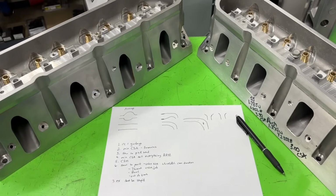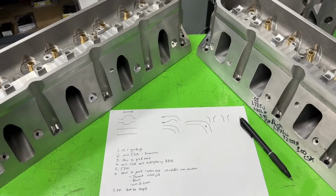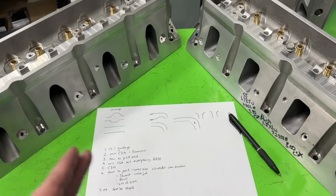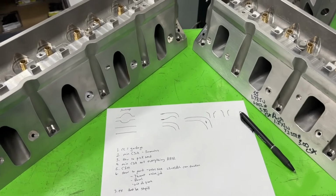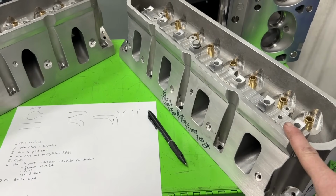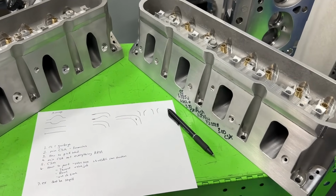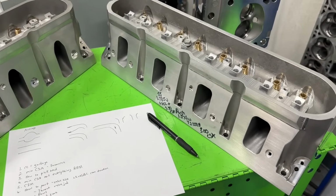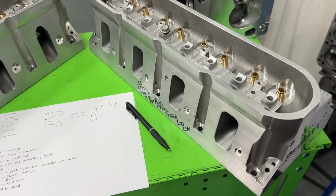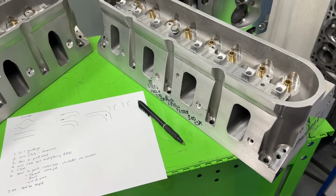Some people will regret it, but it's easier to be smaller on the CSA side and be less of an issue. At least you make torque at certain areas. If you go too large, it doesn't necessarily make you a dog down low. And I know some people are tapping right away. Remember, a stock LS3 head is gigantic. Its CSA is like 3.2, okay? Huge. Remember, a 6 liter is essentially 360-something cubic inches. Way more cross section than it needs. Still makes great torque.